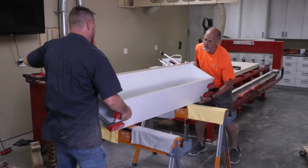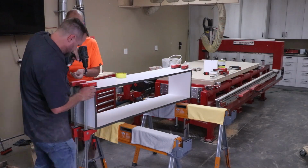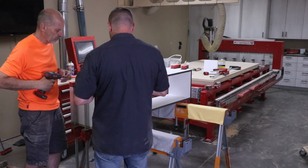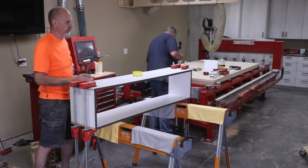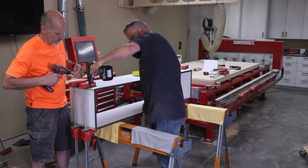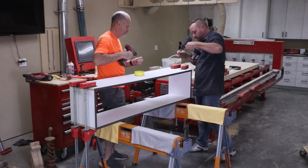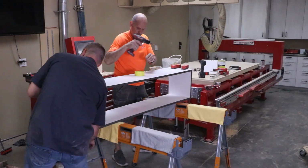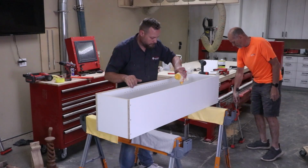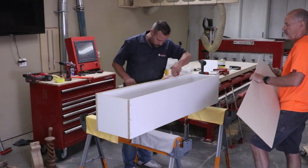The only critical item during this assembly process that we had to pay close attention to is to make sure the edge banding is flush for all four sides of the box. Once we've applied some glue, the clamps hold everything in place and we can quickly insert some screws. In total, there are 13 boxes that need to be assembled with 7 different box sizes, but each box follows the same process of putting it together.